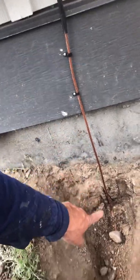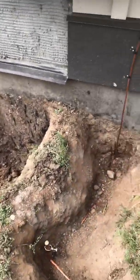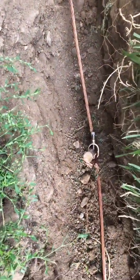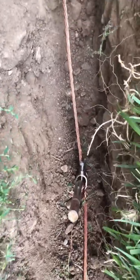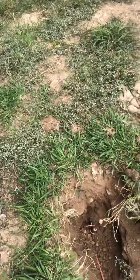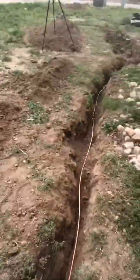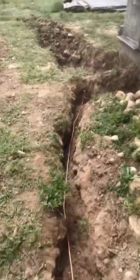The number two electrical wire goes into three grounding rods. This one is seven feet in the ground, this one is six feet. Notice the copper number two wire is connected to the grounding rod with what people nickname an acorn clamp. Then it goes to a third grounding rod. So we have two rods greater than seven feet and one at six feet, totaling about 20 feet. You can see the number two bare copper cable going to the three grounding rods.